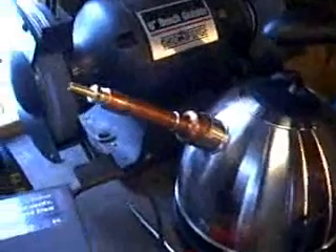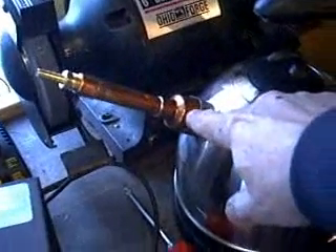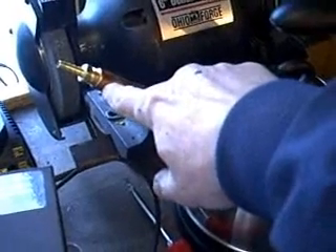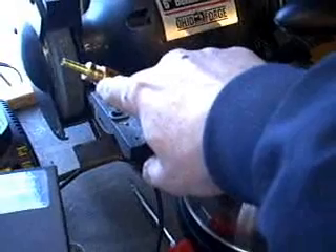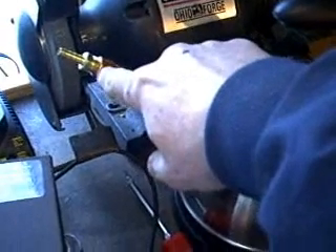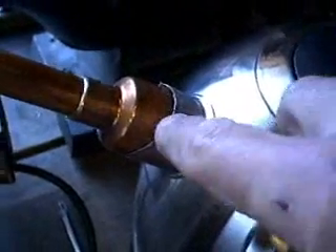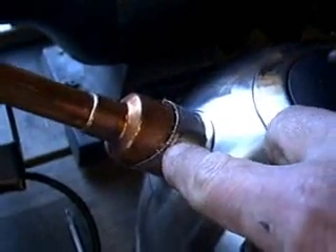The reason for that is because I have this General Electric kettle. What I've done here is taken some copper fittings and soldered them together — sweat fitted them together. There's an end cap here. I took my 1/4 MPT thread tap and drilled it out and tapped it, and I have a 1/4 MPT barbed fitting on the output. If I get in a little closer, you'll see that I've just glued it in place here with some marine goop.